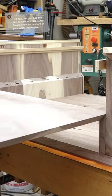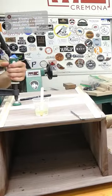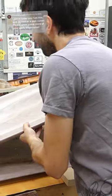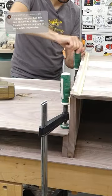Next I'll add in the center compartment bottom. Similarly, the case needs to be flexed a bit to allow the dominoes to go in. This time I'll bend the top by clamping it across a block of wood. Once the joinery is seated, I can remove the block so the case is sitting flat on the bench and add a few more clamps.